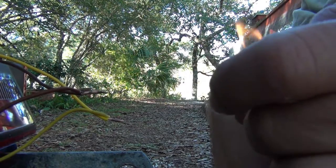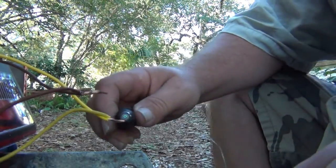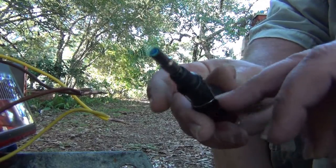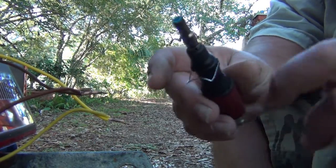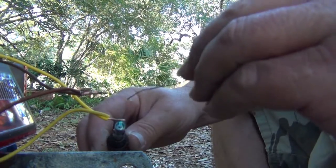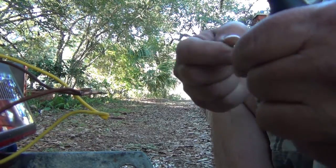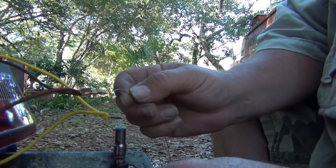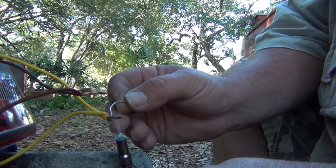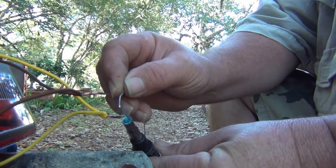Let's start up the torch. This is a small soldering torch from Radio Shack — works wonders. It's got a nice little flame on it, it's adjustable, it's got a little stand. I'm just going to heat up these wires and hit them with a little solder. Heat that wire up until you see a green flame come off the other side of it, and then your solder will stick right to it. I'm doing this without my glasses on — damn it, my glasses are in the house.